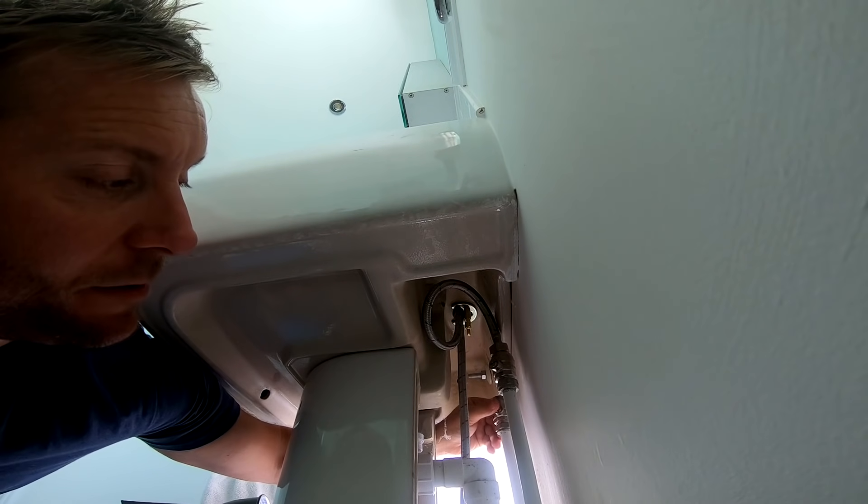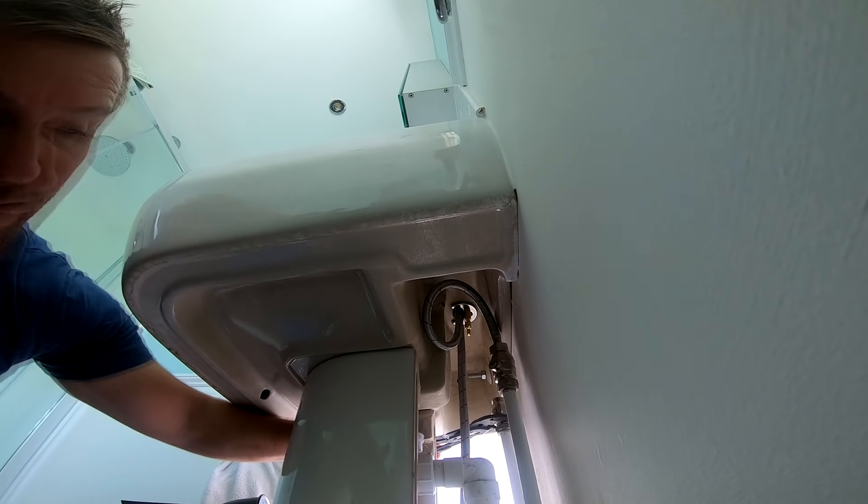I'm actually going to point both of them this way, because they kind of both want to go this way - the easiest place to get to these two is from this direction. So I want to draw your attention to something now. These two are on, so we've done our work. We've got the valves on down there, and everything's switched off. When you're doing a job like this, it's very important to have control over the situation, especially when you're turning the water back on. What we can do is leave two taps on like the ones near the bath, which are right next to where we've just been, and then go and turn the mains water on and turn all the supplies back on, because then we've got control over the situation - which is very important.